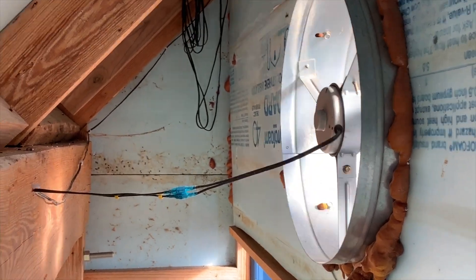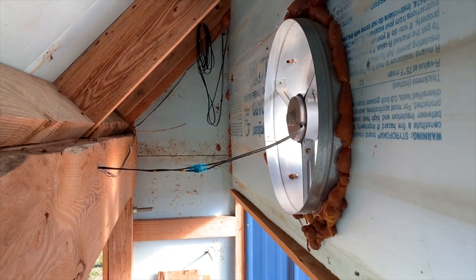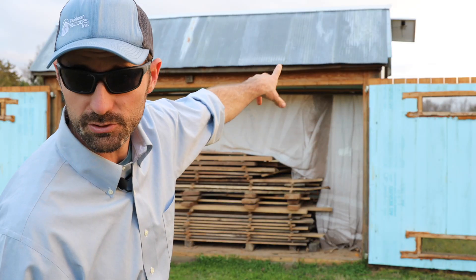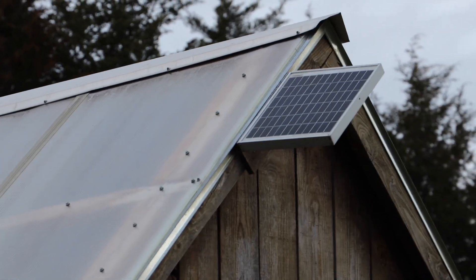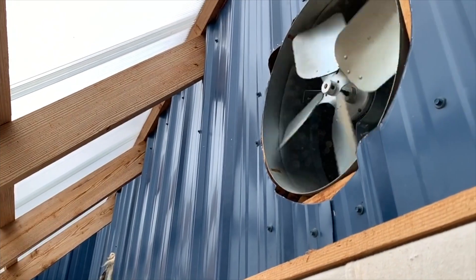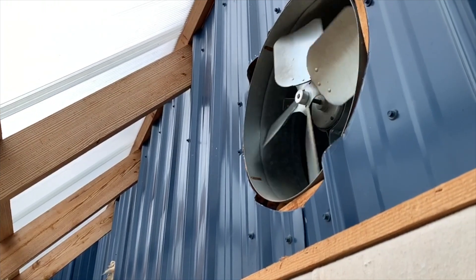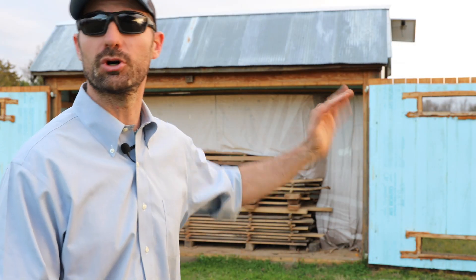To circulate the hot air generated by this greenhouse effect and force moisture out of the wood, we use two solar powered fans. They're direct wired to little solar panels on each corner of the building, so when the sun is shining it's spinning those fans and moving that hot air down through the lumber and out those bottom vents. When it's cloudy and cool those fans don't blow — it slowly builds heat but still can ventilate without needing to push air through.